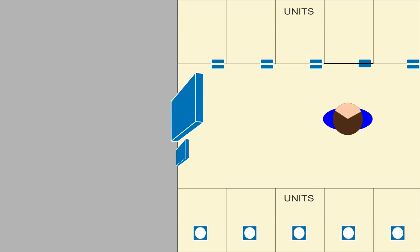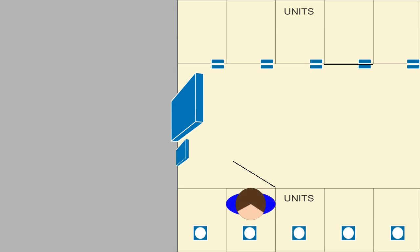Essentially, the door contact will be set to either open or closed, and the PIR will act in the same way. It will watch for activity, and when it sees your customer in her unit, it will assume that the unit is opened. When activity stops for a period of time, the PIR will read the unit as closed, and your customer will be transferred to the next countdown.